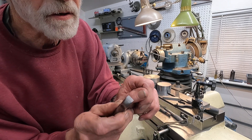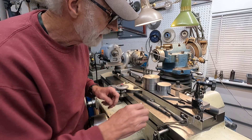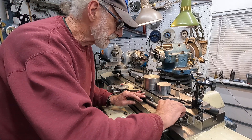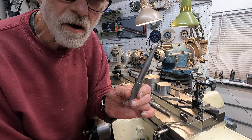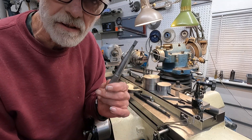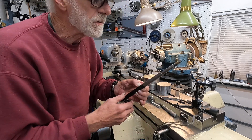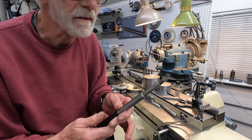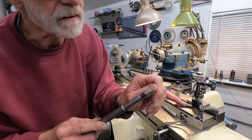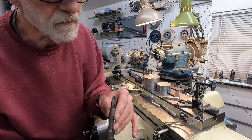You get a very, very sharp edge — see, it shaves a thumbnail. This is the little scraper I made earlier when I brazed the carbide on, and that's just really nice. But these other ones, like this one here, are really nice for scraping paint in tight areas, but it's dull — it won't shave a fingernail very well.